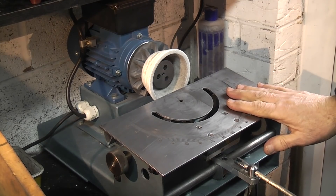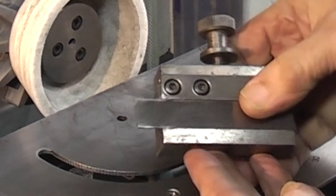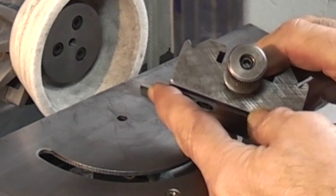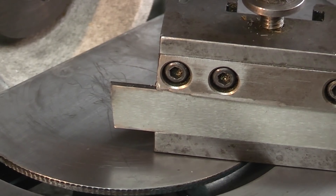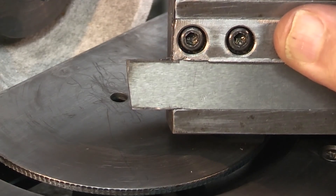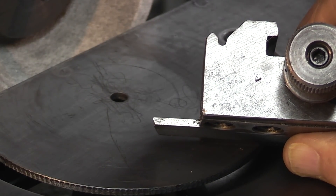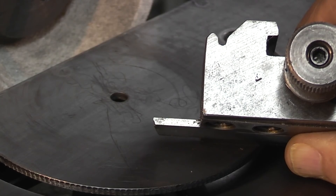The first thing I've done is set the table so it's leaning back. What we want to sharpen is this parting off tool — high speed steel — where I've broken the corner off, so it's completely useless at the moment. You can see on the corner of the tool it's chipped off, and if you look at the top it's diagonal instead of being square, so I need to grind quite a bit to restore that cutting face.